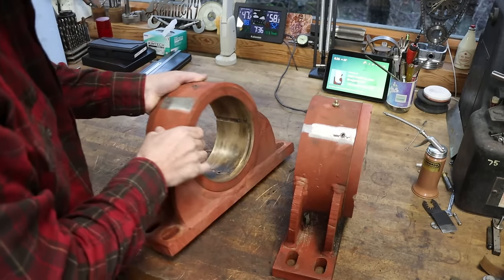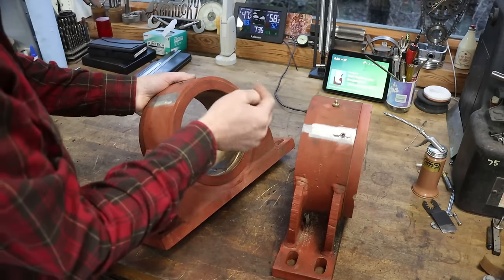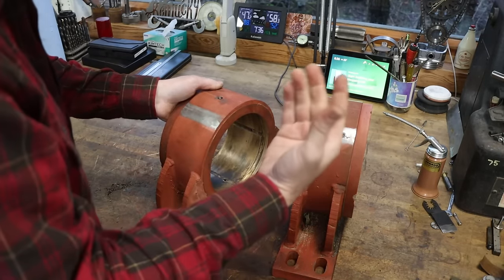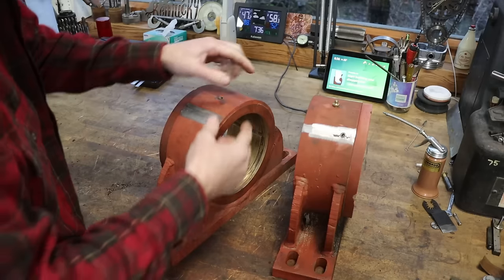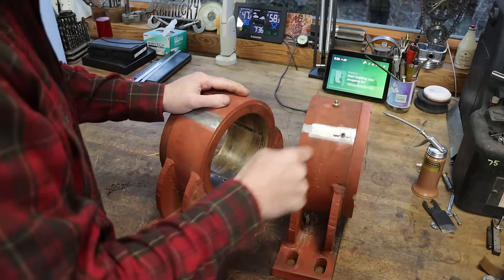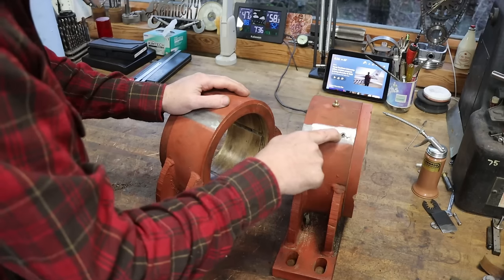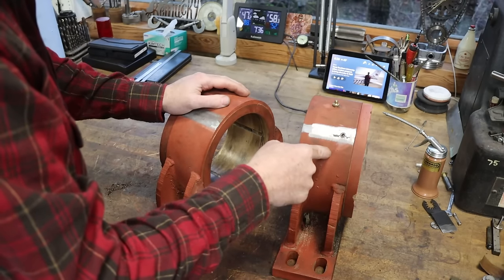bushings into the housings. Because they're thin, quarter inch thick, if you keyed that, you're not gonna be left with much. You wouldn't have to key it all the way across, but you know, the setup time, the thinning of the material, it was easier just to drill 3/4 of the way through, use a bottoming tap, sink in a set screw with red Loctite.